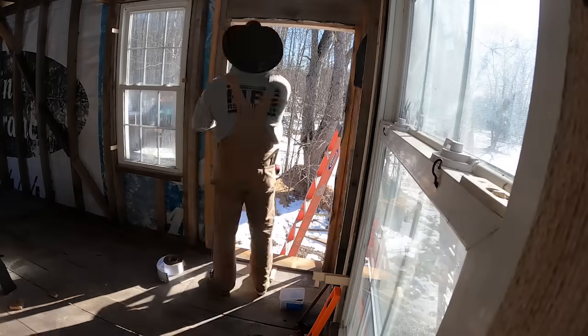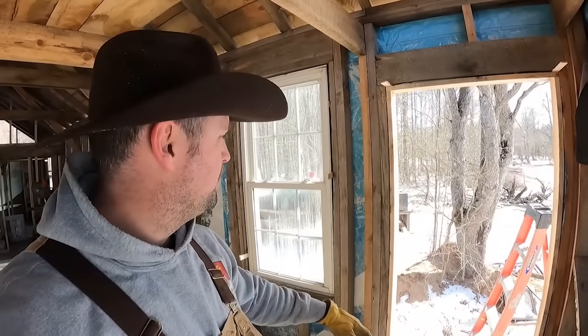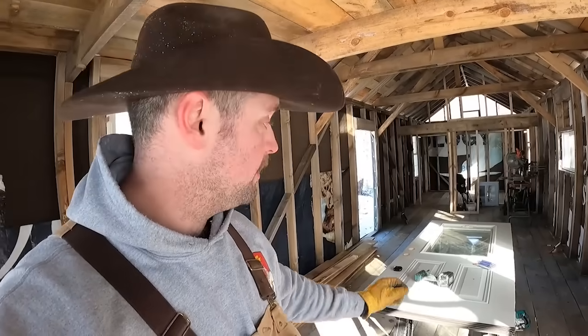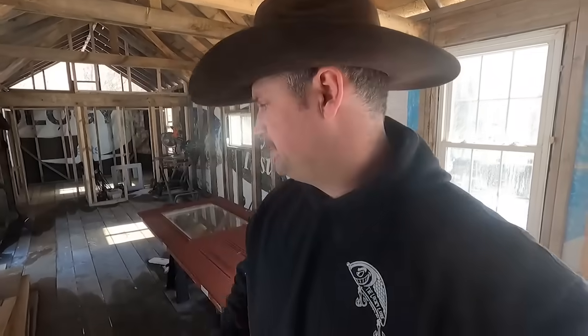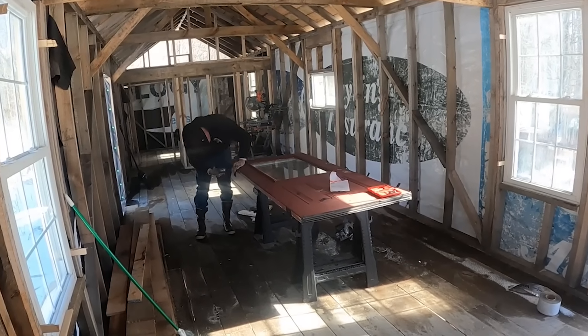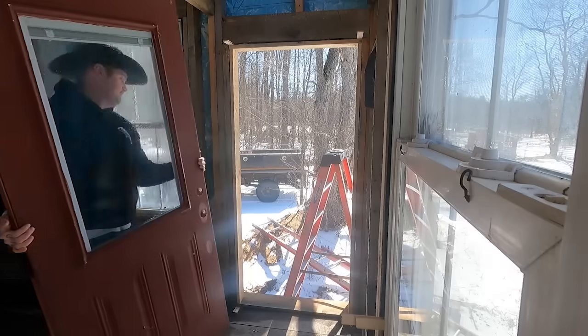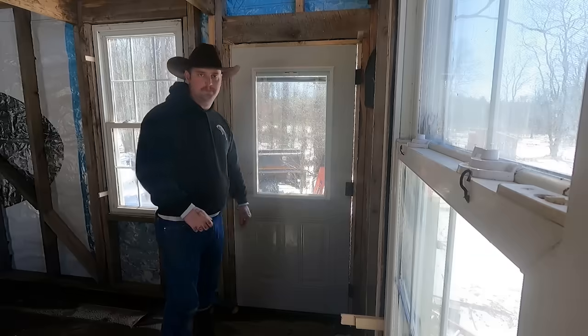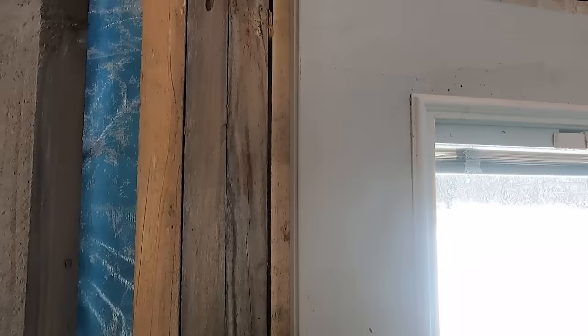I should mention I've never done this before — we're really just making it up as we go, but I think it's going to work. All right, so we got it all up in place, got everything shimmed, got to screw it into the jack stud. It's pretty close to square and I've got an eighth of an inch of clearance all the way around. So it should fit this door — this door that I can't hang right now because I bought the wrong hinges. So I'm running up to the hardware store to get the right hinges, and I think I need to get a chisel. We got it solid and real close. That little gap at the top is no big deal because the door is going to sit against the stop on the outside, but we're a little tight down this edge.